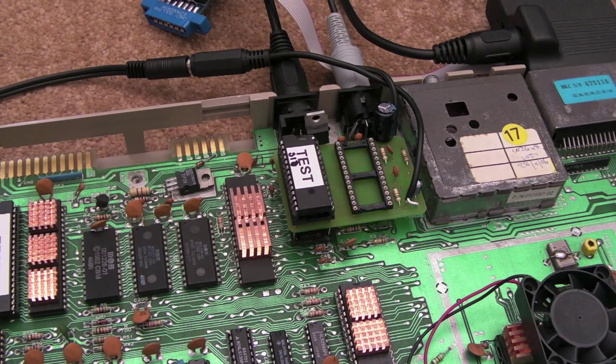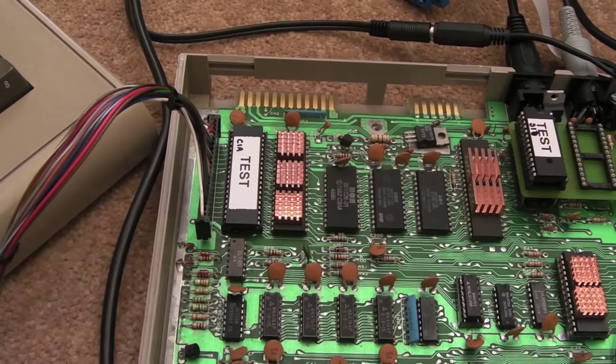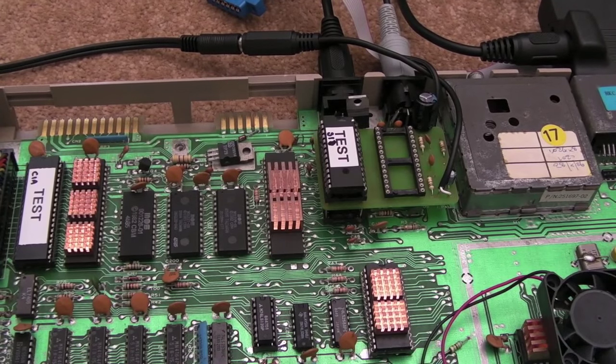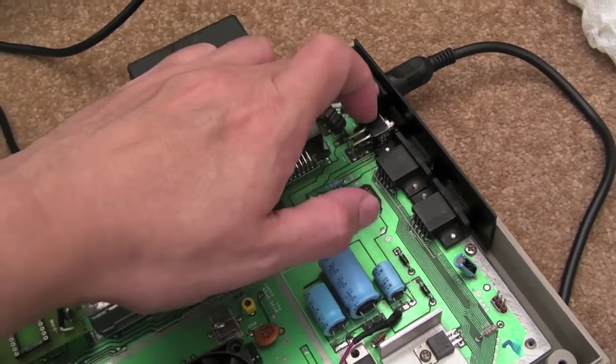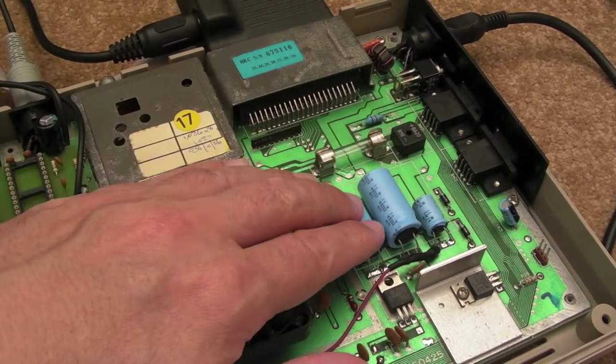But it's just all coincidence. I had that particular problem, and then roll on a few weeks later after I sorted it and swapped out the CIA, that problem came back. The power supply wouldn't have helped either — there was 0.6 volts ripple on the 5-volt line. It needed desperately recapping. Bad connections, the switch wasn't clean, the socket was awful. These are all things I should have checked when I first got it. These are all things you should do — get them out of the way when you get one of these. Recap it, disassemble and re-lubricate your switch, clean up your socket.